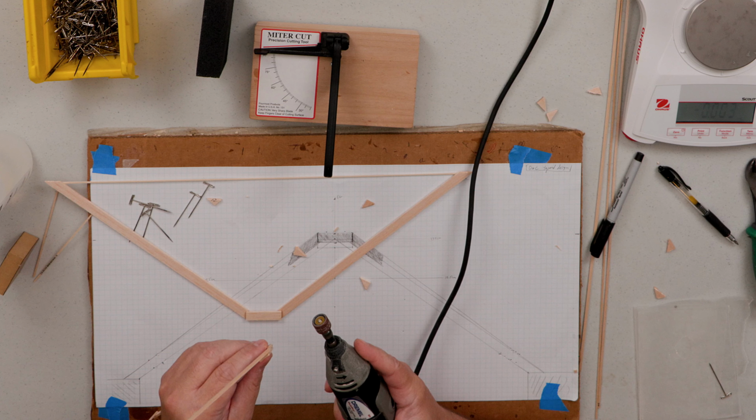I also recorded the completed sides, the final weight in the as built condition, with the relative humidity about 60% right now, which is pretty high. After it's been in the dry box for a couple days, it typically loses maybe 2 or 3%. Then I record how much dead weight it held in my test, and then the score. In this case, the actual efficiency was much higher than even the score with the bonus. So what can we learn from this?